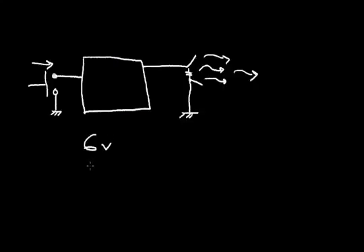I want the current in standby drawn from the battery to be as close to zero as possible — so I from the battery B is equal to zero, or as close to zero as we can get, until it's triggered. When it's triggered, it can draw a lot of current, and I want the alarm to sound for perhaps 60 seconds, plus or minus — it's not real critical. So in this video and in the next several videos, I will be explaining how to design this circuit using bipolar components, resistors, and capacitors. If you can follow and understand this design, you will be on your way to becoming a good bipolar circuit designer.